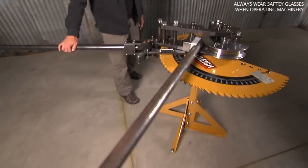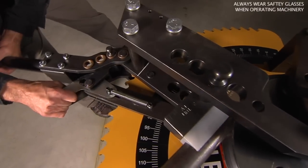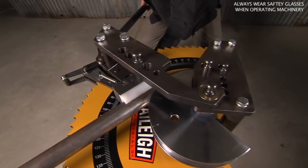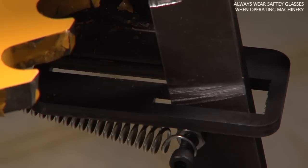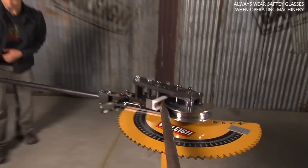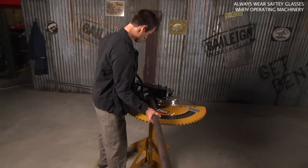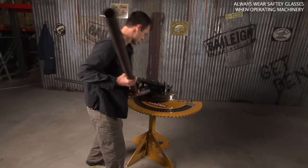What I'm going to do is show you how you release it. There's this mechanism that you pull, release it back, get it close, and I'm going to pull just a little bit of pressure off in order to take the notch, take the release. Now as this swings, we're basically in neutral, so to speak. We can pull it back around, and it's real easy to pull your pin and get your tube out.